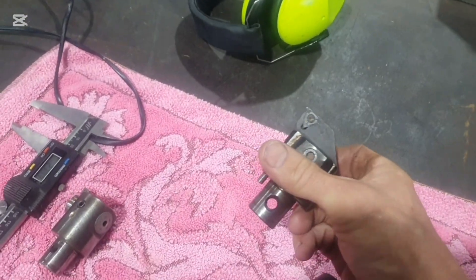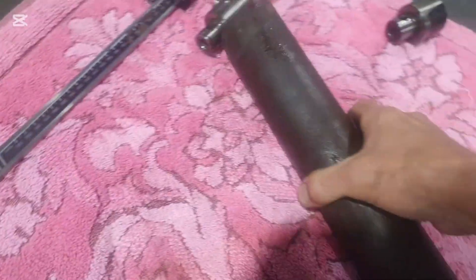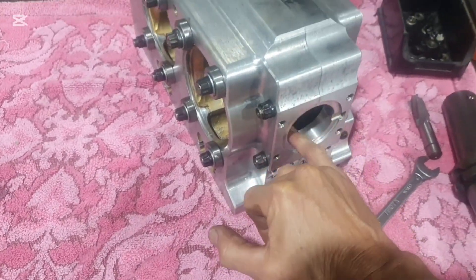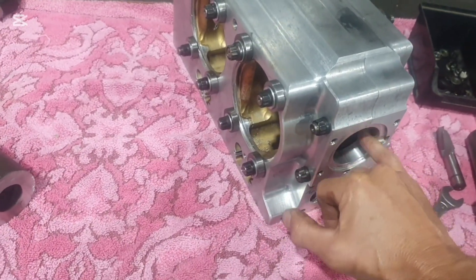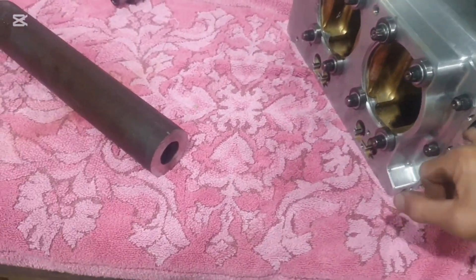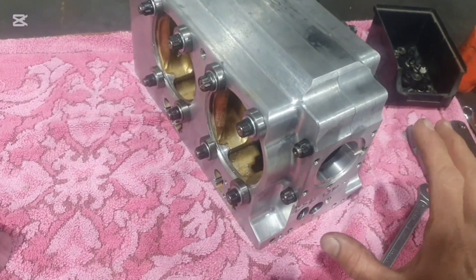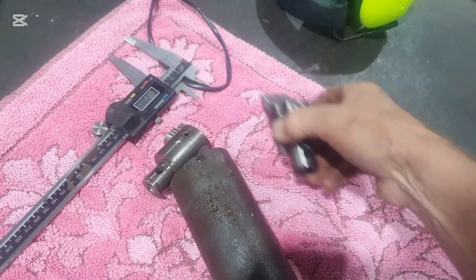This is the one I used prior. What I've done is I've cut a piece of chromoly steel — it's hollow bar, which is ideal. I'm going to face it all up, turn it, and grind it so it's exactly 52 millimeters in diameter, but minus 0.05 of a millimeter — that's five hundredths. Take a millimeter, divide it by a hundred, and take five of those off the diameter. That'll allow that shaft to run in those first three bearings with quite tight tolerance with a little bit of oil on them.